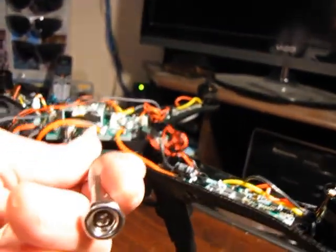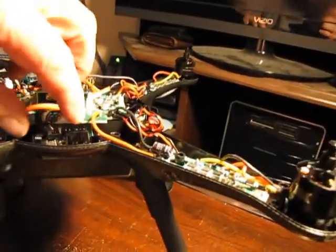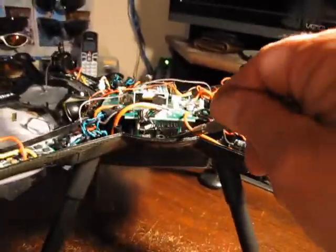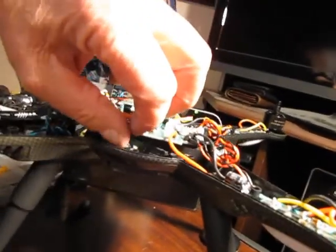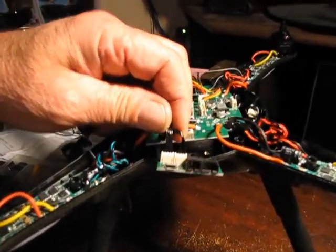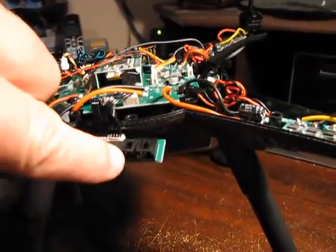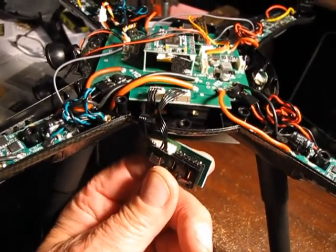I'm going to pop this card out right here. I just go in here and pop it like that. Now once I get it popped out, all I got to do is clear the bottom board. Now there are the plug connections that are fitting in the bottom of the quad. We are going to solder two cables from the red and the black, the battery connections, and run them straight over to these solder points on the back side. Then I'm going to put it back in, and that'll give us a little bit more amperage so we can put more devices on it.